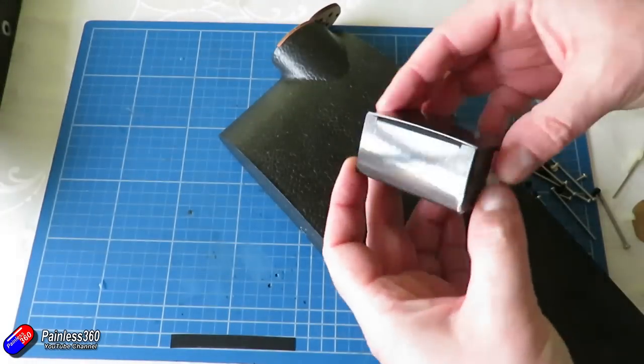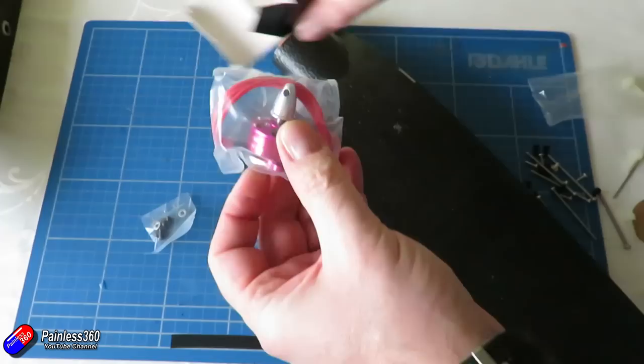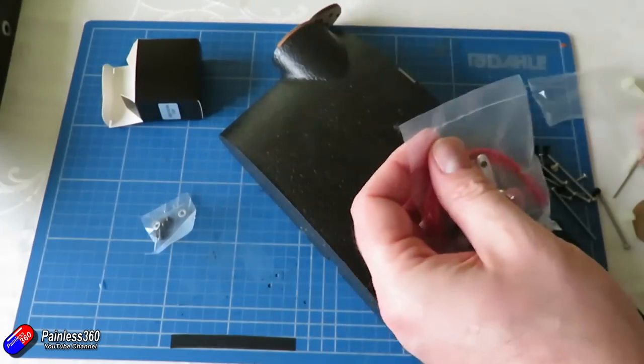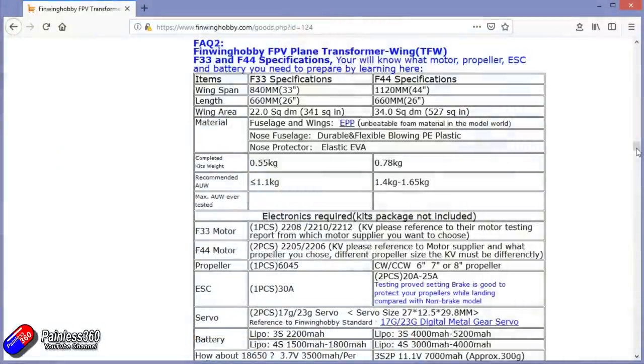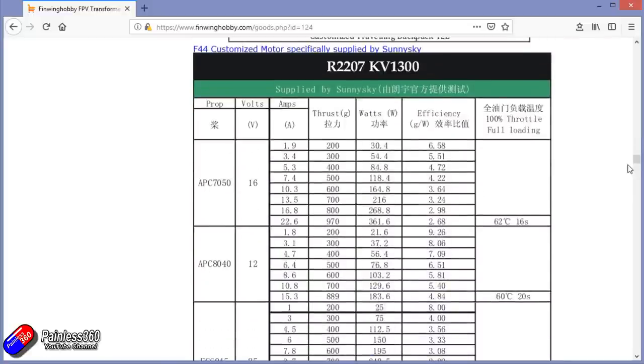Before I get into all of that detail, the first thing I need to figure out is what kind of props and motors I'm going to put on here. I'm actually using 1300 KV motors and looking at the thrust data for these particular props. I'm interested in using a 3S battery — most people would use 4S or bigger on something like this. The reason I want 3S is because it allows me to replace it with a similar lithium-ion pack, which is a great way to get really long flight time. So I'm after efficiency, and the best efficiency I could see in the table was using a 3S battery with 8-inch props — that's what I'm going to be doing here.